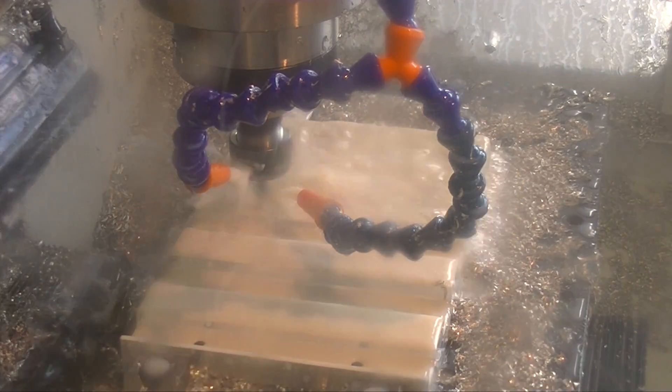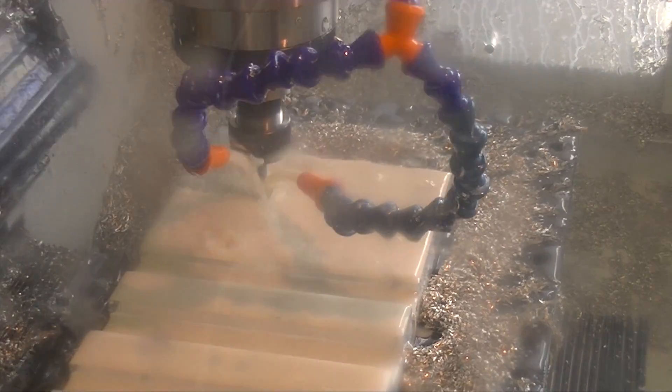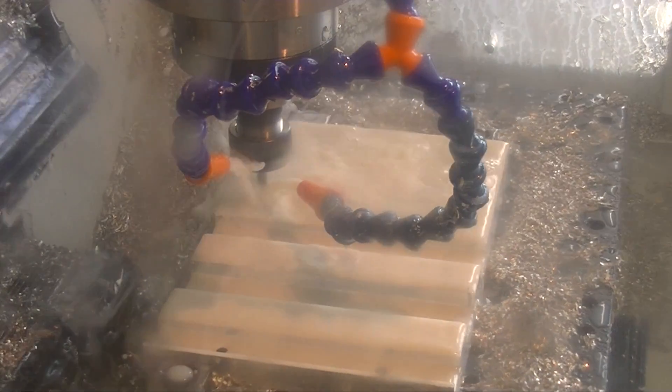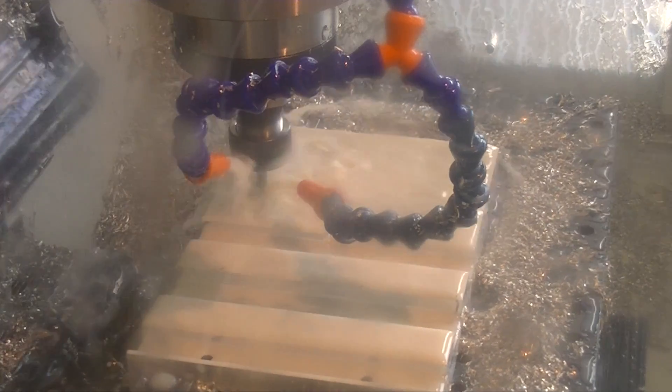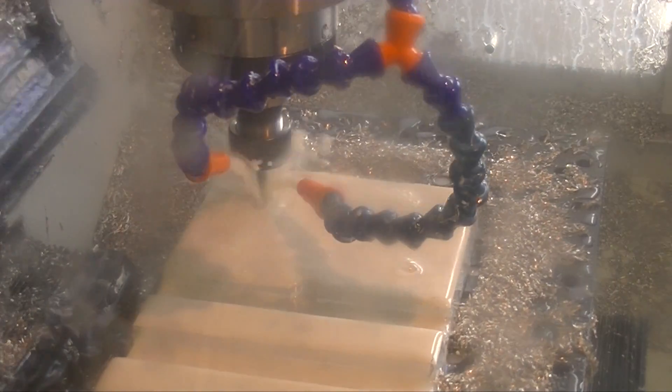You can kind of see in that back side where the way cover has just gotten destroyed — that accordion cover is not working, it's broken at this point, I've got to replace that. And the Z cover, you can see it sagging as well, so both of those need to get replaced. Once these contours were done, we came in and did the contours for the actual handle itself — cleaning up the handle locations — and then we are ready to get it deburred.